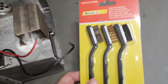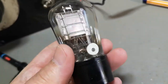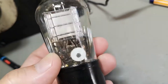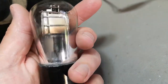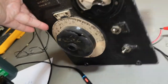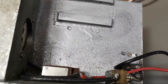I think this is going to work - just went shopping for something to clean this up. This is clearly a low voltage tube - look at the distances in here, and it's also a directly heated triode. Look at that, so that is what it is. I tried to clean it - it's a little bit difficult. There are no numbers on anything, and also not on the spare tube. I've got 1.4 volts here and I'm ready to put in the tube. I cleaned up everything and sprayed some aluminium zinc spray after all the cleaning.